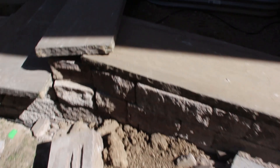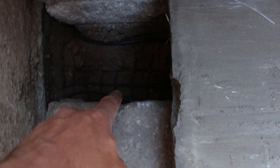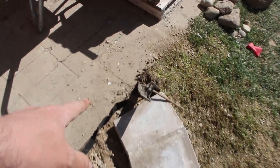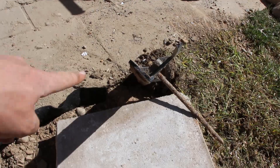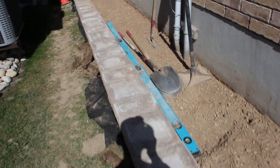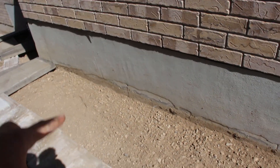We're getting real close. Caps are essentially just dry fitted, I got some cuts to do, and lights I'm going to do tomorrow. Wire is run through each cap and there's a loop of wire available underneath each cap for the lighting. Wire runs under the pavers and underneath the deck. Caps are glued. These caps here are not glued, but we did complete this wall — we'll have to have a transition zone because this wall cap is level but the driveway is sloped over there. This is where our pavers start so this can be fudged a little bit to make this transition zone as good as possible. We also compacted the gravel in the front garden bed. Tomorrow we're ready for lights, cutting the caps, filling in the gravel, and installing the pavers — hopefully that's done by the end of the day tomorrow.